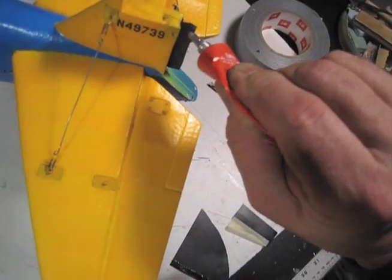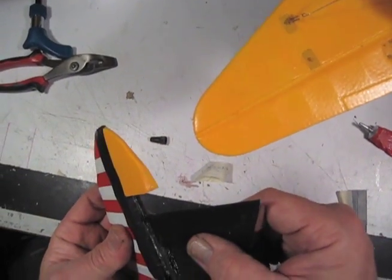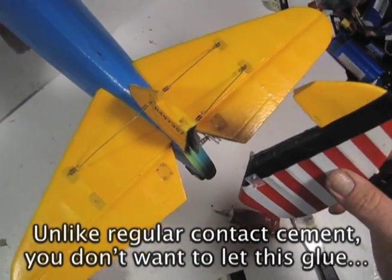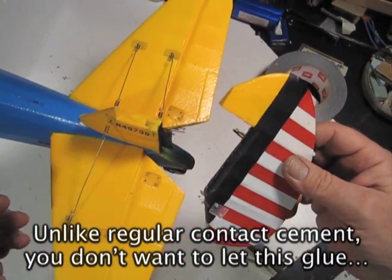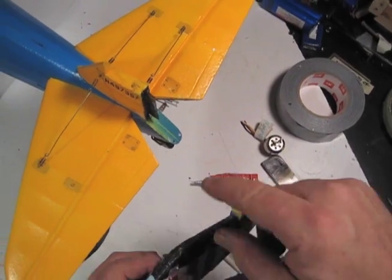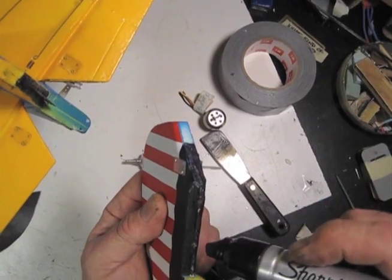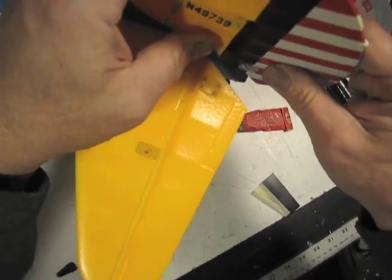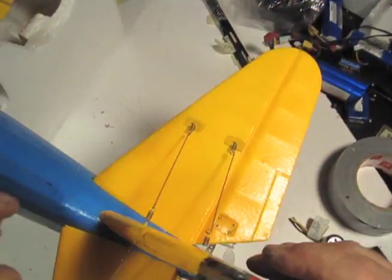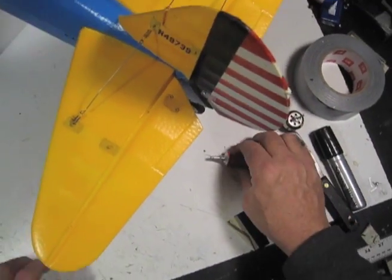Take a piece of tape and remove the excess glue. Now put some glue onto the tab and use the same piece of HDPE to smear it around, then take the excess and put it into the slot. I can gauge the stickiness of the slot at the same time — not too sticky yet, and that's good. We're not going to wait as long as we normally would with contact cement — just about 30 seconds, enough time for it to start getting tacky, since it's in an enclosed space. The more both sides dry, the harder it will be to slide it into the slit, so we don't want to overdo the dry time. While we're waiting, let's touch up our black. Okay, that's enough waiting — let's put it on, work it into position, check everything, make sure it's all nice and centered, and give it a few squeezes.